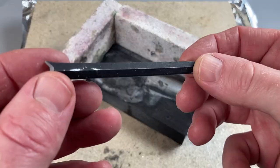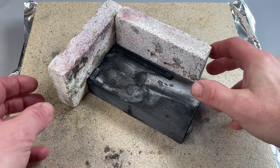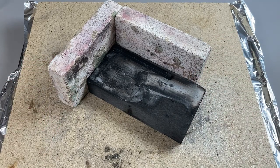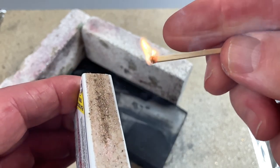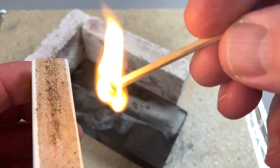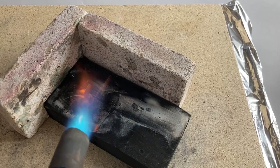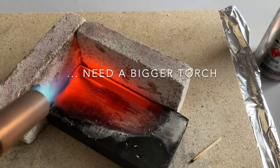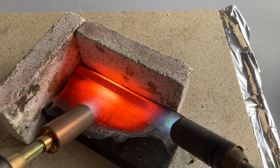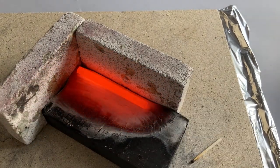Once I've got rid of the curved bit of the Allen key, I'm going to anneal it. So I'm going to heat it up to bright orange, hold it there for 10 minutes, and allow it to cool really slowly. This hopefully will soften the material enough. This kind of complex tool steel that these hex wrenches are made from doesn't anneal that easily. Ideally you would put it in an oven or start with annealed stock. So I arrange my mini hearth, get the gas on, find one blowtorch doesn't have enough heat, then move on to two, get the heat into it, allow it to soak and then allow it to cool slowly.